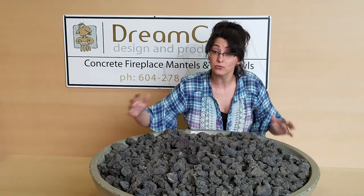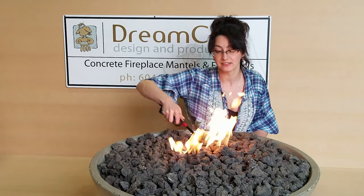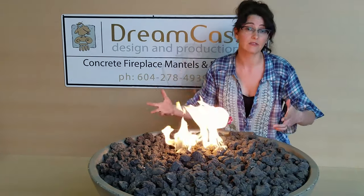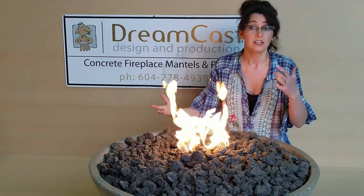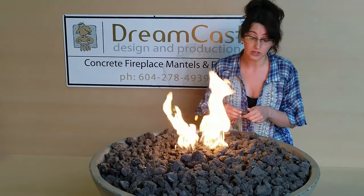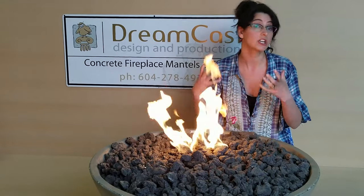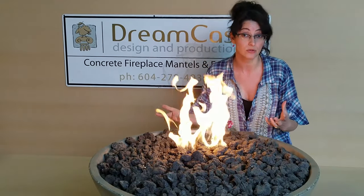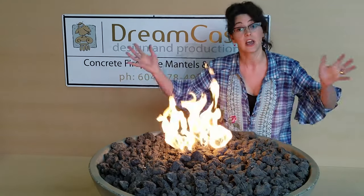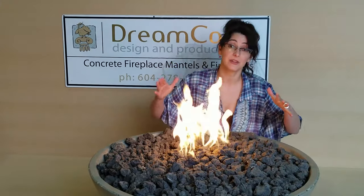You'll see this beautiful campfire flame. You'll be able to move the lava rock around to get different effects with the flame. Some things to know about lava rock: it starts off black and will turn a slightly gray color as you burn it regularly. Lava rock does break down over time, so when the new season comes, it's important to scoop out all the debris, shake it up a bit, and put the rock back in.